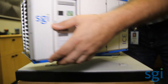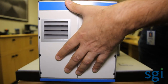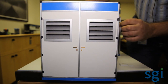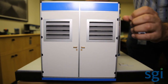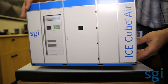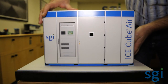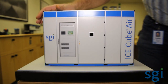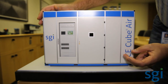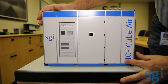I'm going to rotate this thing back so you can see that we have the exhaust in the back. These are the exhaust louvers — they're all automated louvers connected to the control system. This is the head unit. It holds four racks at 51RU and can hold four-post racks or four standard 24-inch roll-in racks or cabinets. There's a primary door here for entry, and another door where you see the words 'Ice Cube Air.' This is what we call the cold aisle entry, and this is the hot aisle entry.